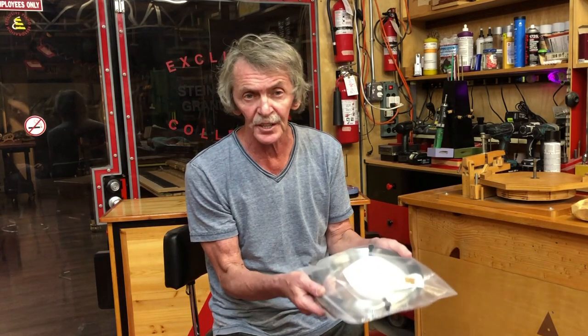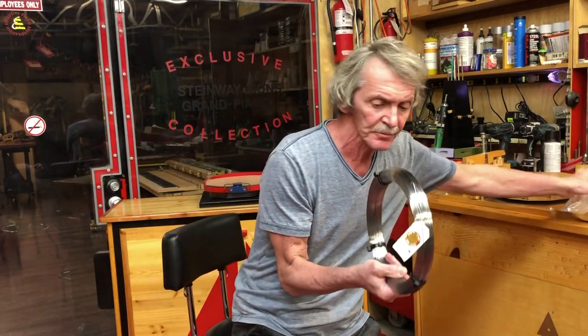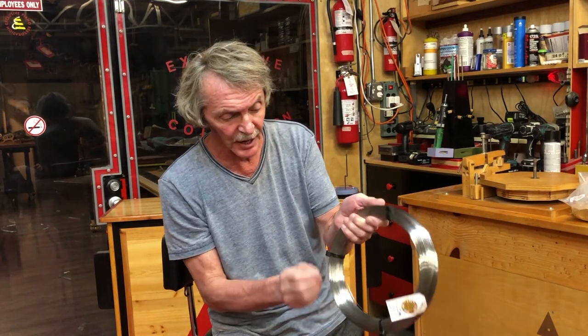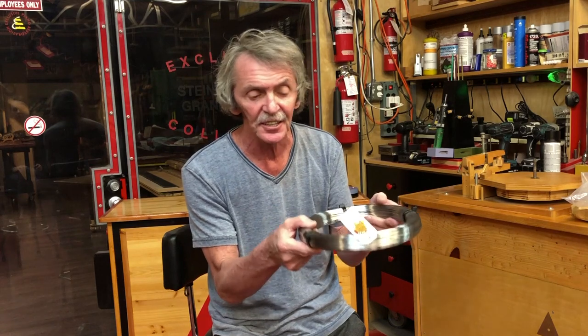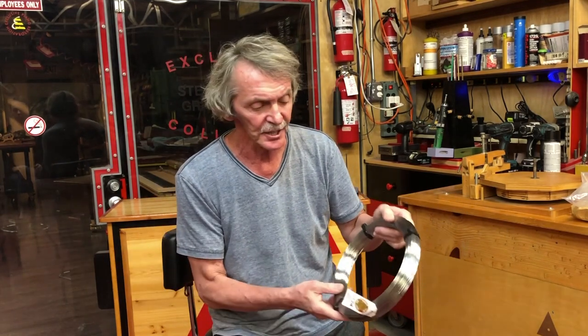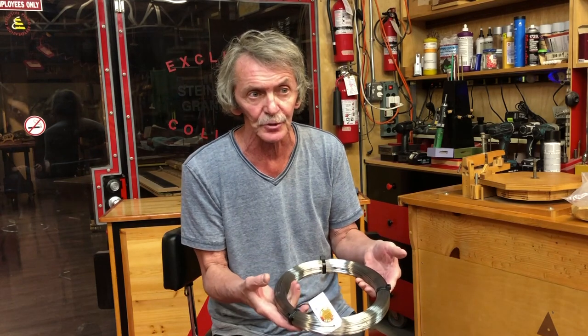In order to organize the coils you need certain storage and a cabinet. The critical thing is these coils come with three hooks. In order to get the wire out it's very complicated — you have to release these hooks, and once you release them all the coils just spread around. That's why you have to make a certain device, a cassette, that you can put the wire into so it doesn't spread around. It became obvious to me that I had to build a special tool.